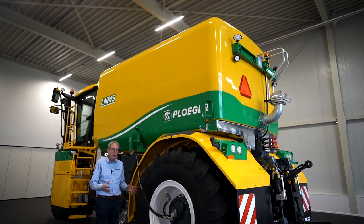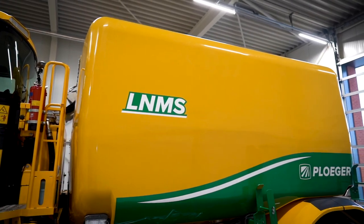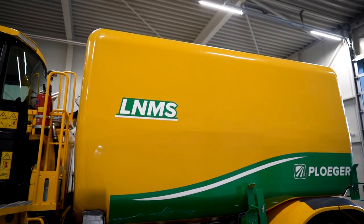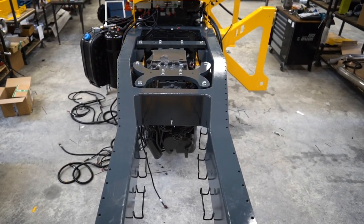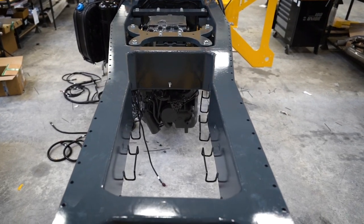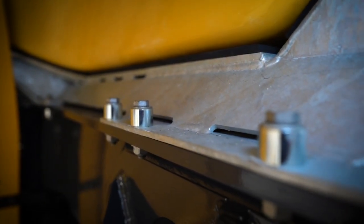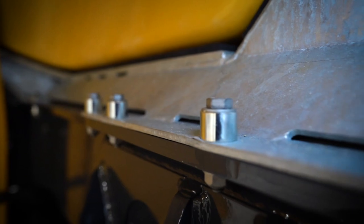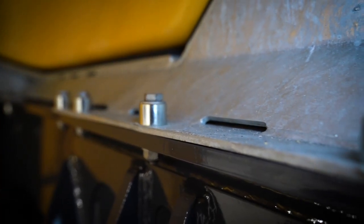A 16-cubic lightweight polyester tank with integrated baffles and pipes, modular built for this unit. Unique is how we build the chassis — it's built from separate plates, bent and then welded together as a tube, in such a way that when the chassis is ready we don't weld anything on it anymore, but everything is bolted, which gives a much stronger, reliable, and durable chassis.